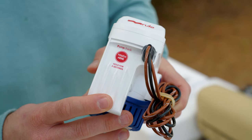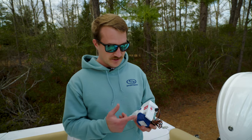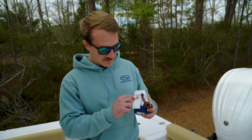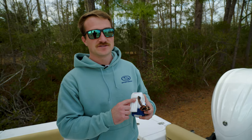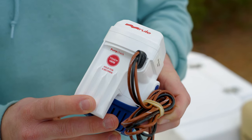The last feature of the bilge pump is very nice. Say for whatever reason it's not working — your dash switch, you don't feel like your float's working at all, you've got water in there and the pump is just not running. You can always go to the back side of it, which has a touch-here button. Rest your finger on there for five seconds. If at that point it's still not coming on, then we know we can start checking the wiring and all your connections to the pump. That's just one more safety feature built into the pump.